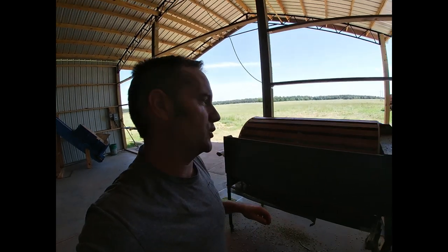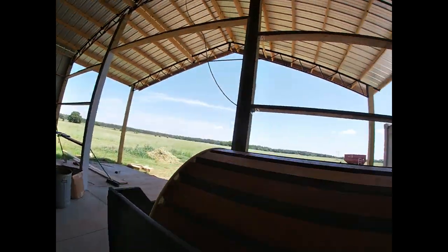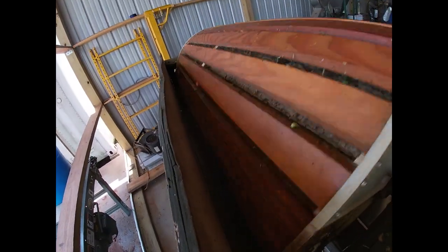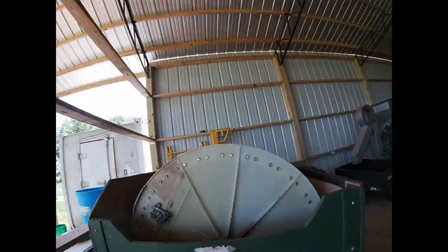The way this machine works is that this slotted drum inside has a row of paddles. The paddles are turning one way, the drum turns the other way. The peas are spun up in the air in the drum and they fall back through those paddles, then the peas are able to fall out through those cracks into this area.